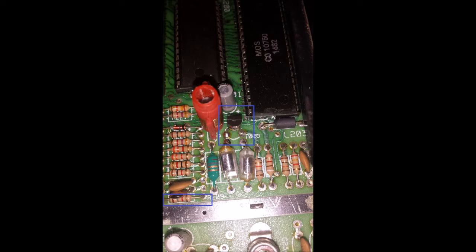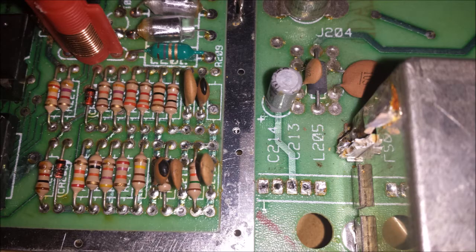The next step is to remove the parts circled in blue — that little tripod component and a little resistor down there. You can either desolder them or just cut the leads and pull them out, but your best bet is to desolder and remove them. Here we have those two components removed, and I've also removed the RF board. I just snipped it off and desoldered a bit. You might also want to remove the big RF box as that can help reduce interference.